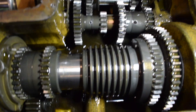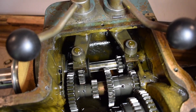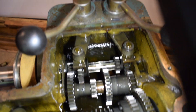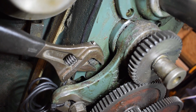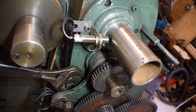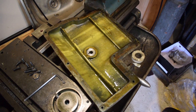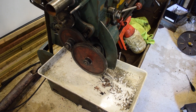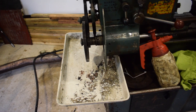I've taken the cover off. The oil level is just below the sight glass, so it's a little bit low, but other than just being old it doesn't look too bad — doesn't look like there's a lot of water in there. The drain plug is just there, a little square plug, so I'm going to drain it out and put some new oil in. I'll clean this top plate out as well. There's only three litres in the lathe so it should all fit in this pan, which just fits under things perfectly — it's so handy having small pans like this.